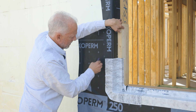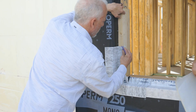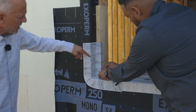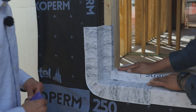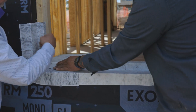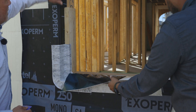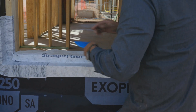This application shows a nice watertight seal. As we move up the rest of the way, Jose can bring down and make sure that all the flashing is supported underneath the window openings. This could also be done with liquid flashing — when the window goes up against the fin, we could liquid flash that inside corner, making sure we never flash the bottom, going up and around the window opening. There are lots of ways to get an ICF flashed properly.